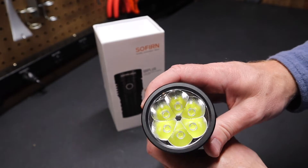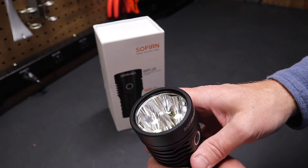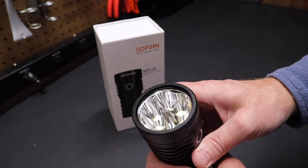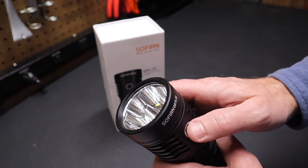If the flashlight is off and I tap this button three times, you'll see it flashes — in this case nine times, meaning 3.9 volts. So it's telling me the voltage of the flashlight with three taps. The battery's lowest charge would show at about 3 volts and maximum charge when fully charged is 4.2 volts. You can see the voltage — that's what I mean by it having a lot of advanced features in the flashlight's firmware.